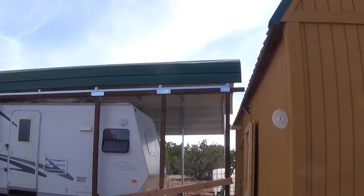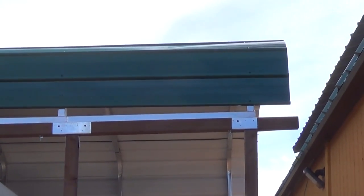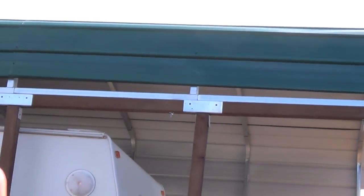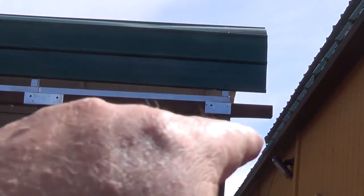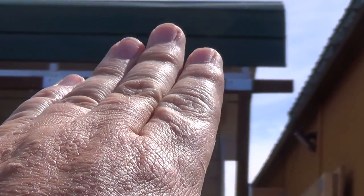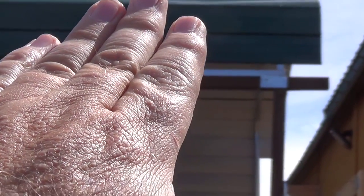There's a little bit of space right up in here — that's just the way it lined up. What I'm going to do is add ceiling joists coming off of here and extending out this way for my enclosed patio. The roof will then have the same material as this, going the exact same way, so it's going to actually bend and tuck underneath it to waterproof it. Then it will come down and extend all the way out to the edge of the barn.